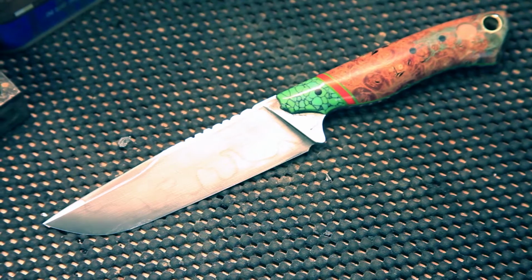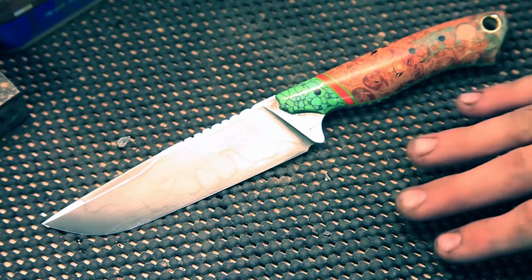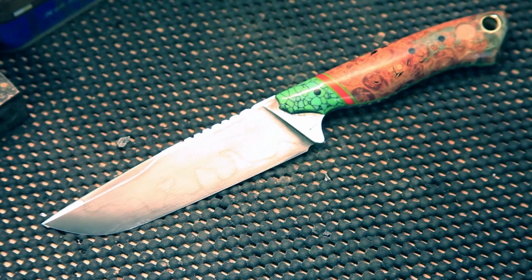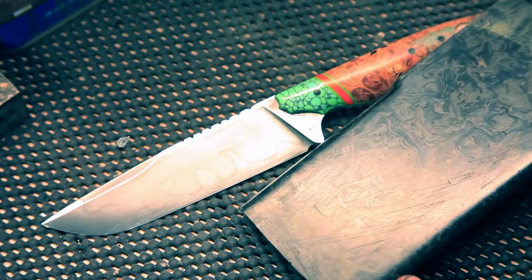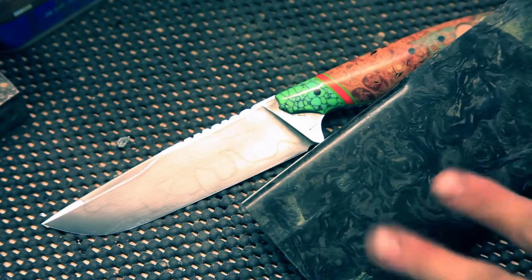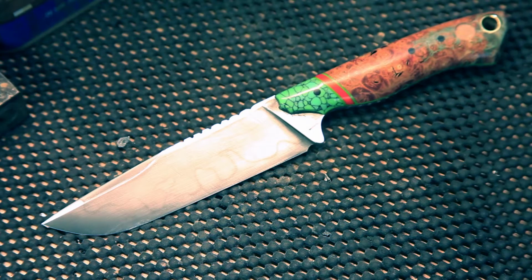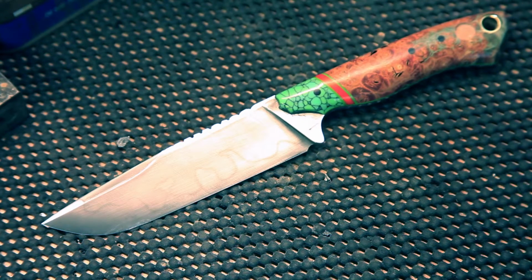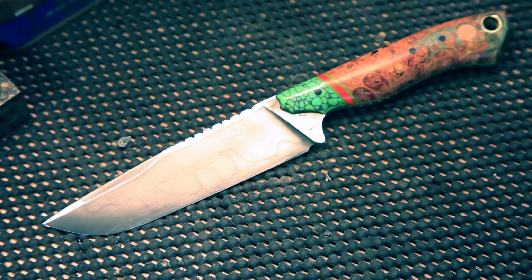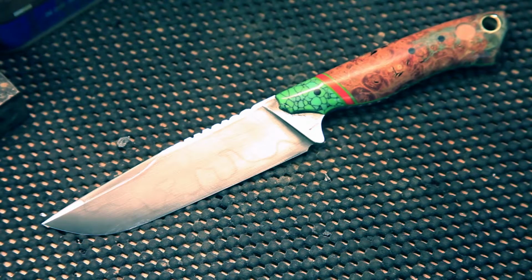It's beautiful wood and it's got a lot of chatoyance, which is that iridescent effect, like a cat's eye stone or the fiberglass, where when you tilt it, it can capture the reflective qualities in the surface because it's broken up and there's different refractions going on. So woods with a lot of chatoyance will tend to clog on a buffing wheel, and you'll lose all that reflectiveness and it'll just turn into a muddy mess. That's all because of end grain orientation and pores getting clogged and so on. We'll get into that much later.